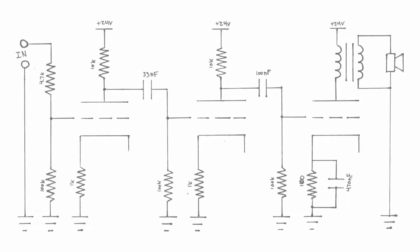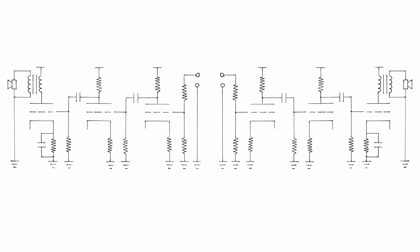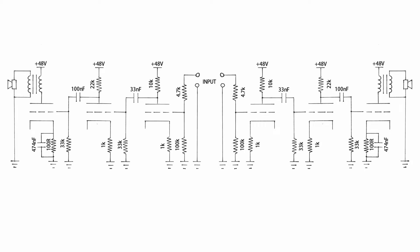Three 12 volt heaters or six volt heaters gets a little strange at 36 volts. So if we bump up one extra level to 48 volts — that's still a really safe voltage, you can stick your fingers in the circuit and you won't even feel anything — that gives us a little more volume, a little better audio quality, and 48 volts means we can run four 12 volt tube heaters in series. Since our current design uses two tubes, we just double it up: the same amplifier copied to the other side. We've got four vacuum tubes, two amplifiers, two speakers, hopefully a lot more sound.